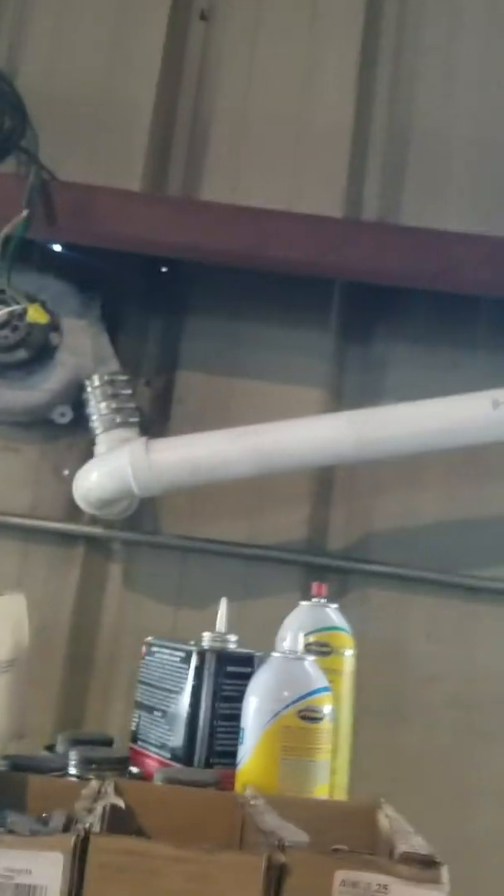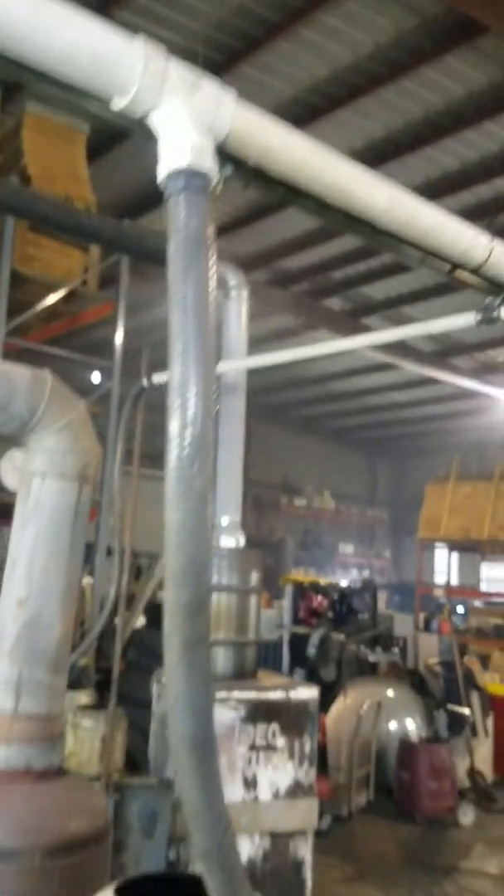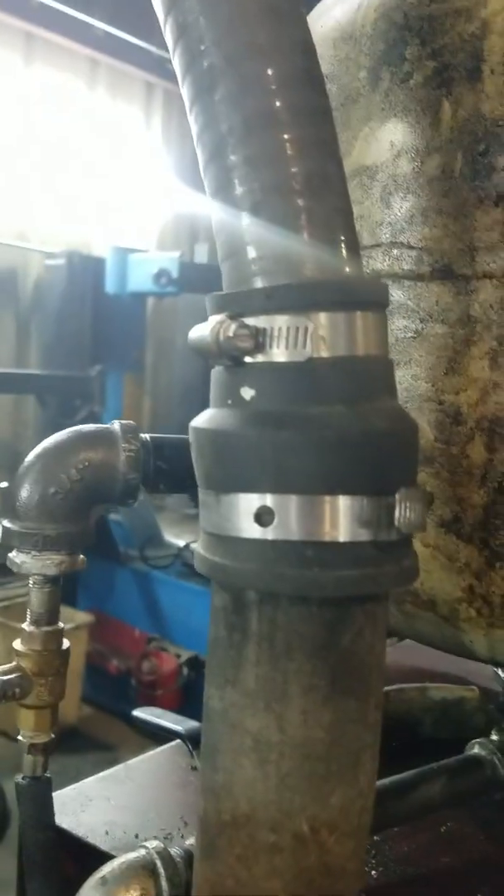I ran outside air so I'm not reheating inside air and blowing it up the stack. I've got one fan that feeds both units. Two-and-a-half inch comes down here to my burner tube, which goes into the bottom of my tank. It's just a 90-degree fitting hooked up to my blast air, with a barbecue-style quarter-inch valve controlling the fuel into the burn tube.